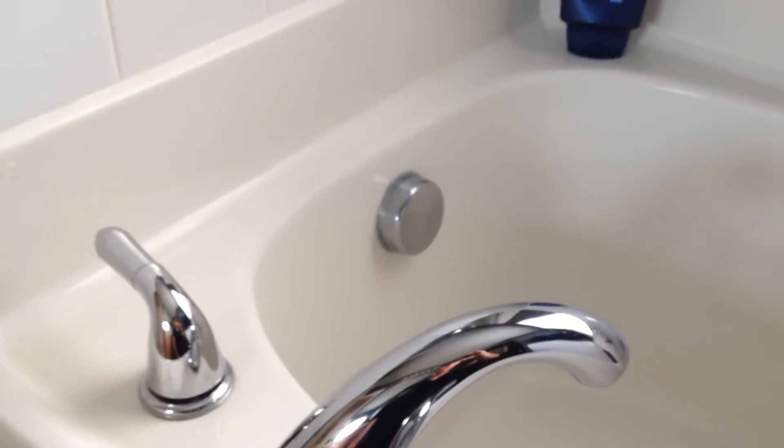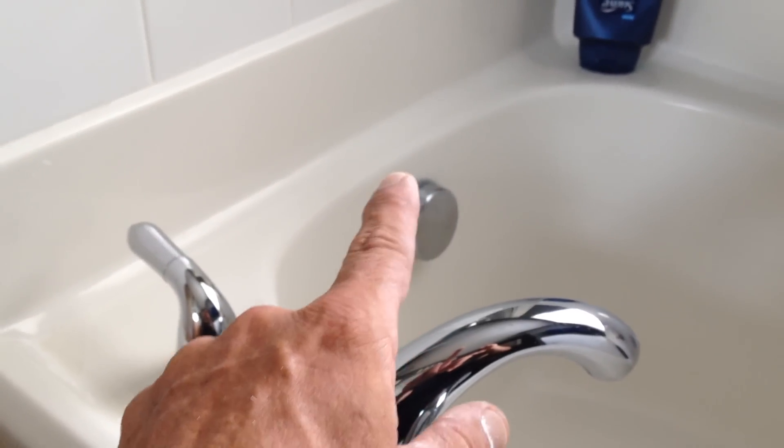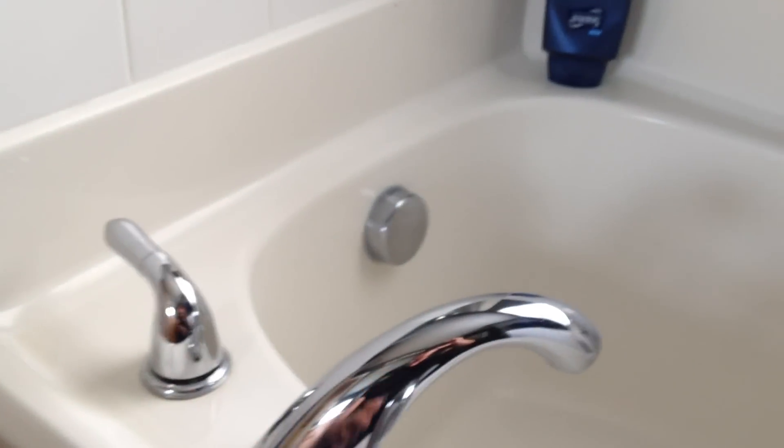All I had to do was take that cover off and silicone the outside — which there was a hole where the plumbers plumb through the tub and the wall and then run their pipe down. All I did was silicone the outside perimeter edge, which is the outside edge of the PVC tubing, and then button that cap back up. Sure enough, did a water test on it — no leak. That was it.